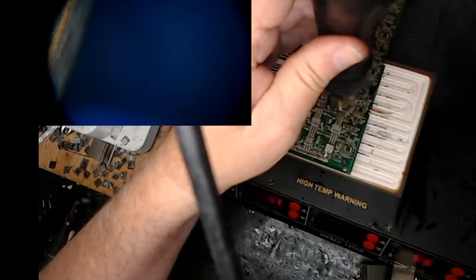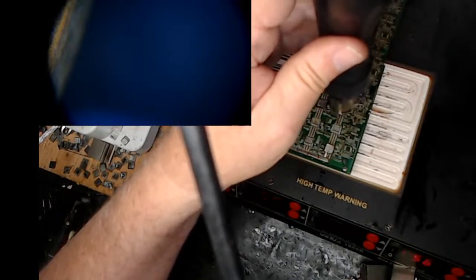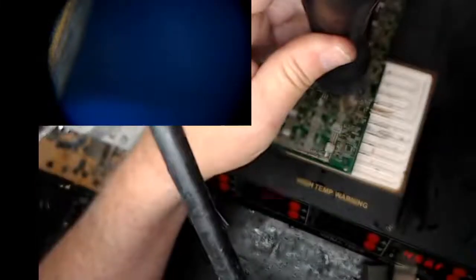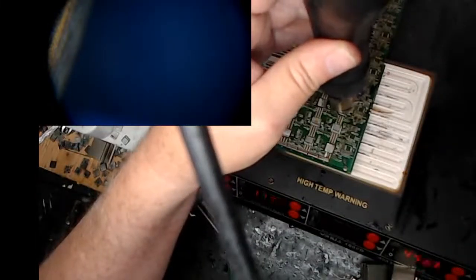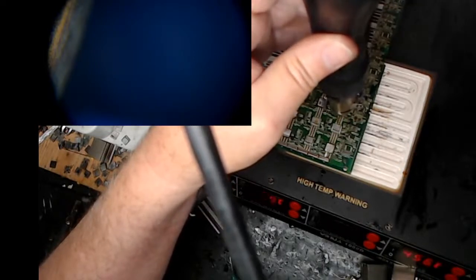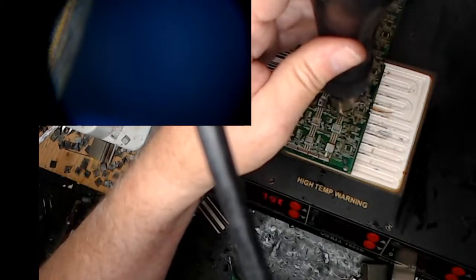And at that point, I know when the chip's not going to move, I go ahead and apply more flux. So I think we're in good now. So I just put flux around the outside of the chip and give it some more. Probably too much flux, but just the way I do it. And I heat a little longer because the flux cools it off.